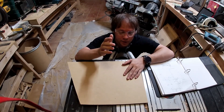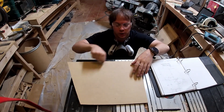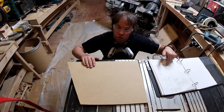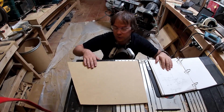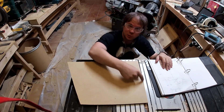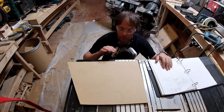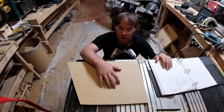We are going to head down to the wood shop and get started with the plans. Down here in the wood shop, the two methods are: physically lay a piece of paper on here and just trace it and cut it out, or use the dot drawing and basically just follow the numbers. I don't have paper big enough, so we're using the measurement method. I've got an extra piece we use for a test bed. Over here is a factory edge, which means it's straight, so I'm going to define a zero and start from there.